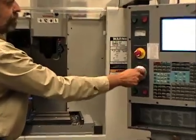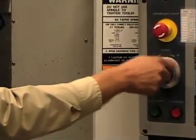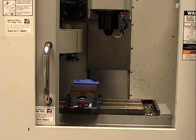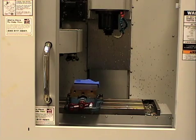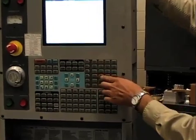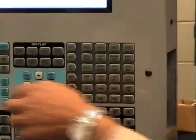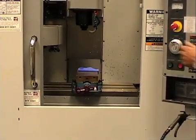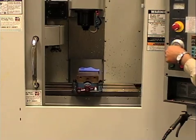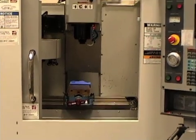I turn the crank lever, and if you notice right now it's not moving very fast — it is actually moving. You can see the vise moving over pretty slowly. Next to the hand jog there are four different speed numbers. I'm going to pick a higher speed, 0.01, so you can see the difference in motion. I can get all the way up to 0.1.